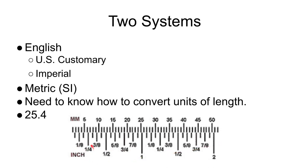One quarter of an inch converts to 0.25 — just treat the slash as a division symbol: one divided by four. Three divided by eight is 0.375. Be able to do that for any inch fraction. In a machine shop, nobody adds and subtracts fractions — we deal with decimal parts of an inch.